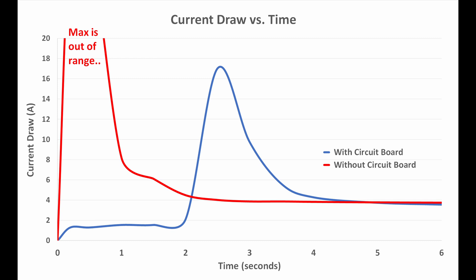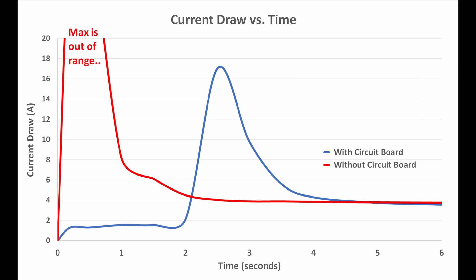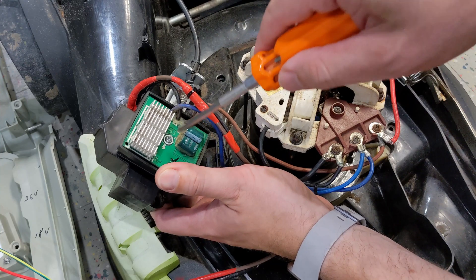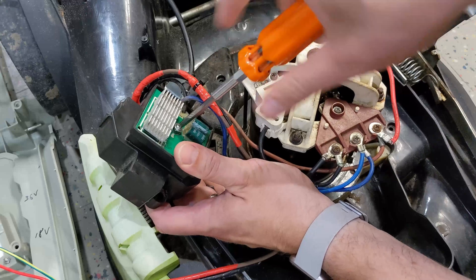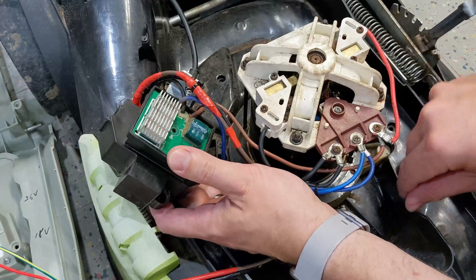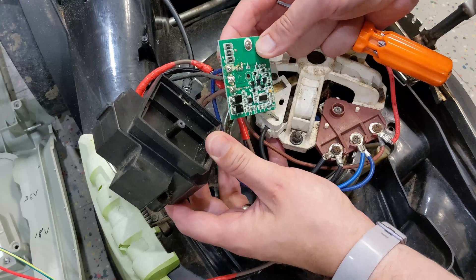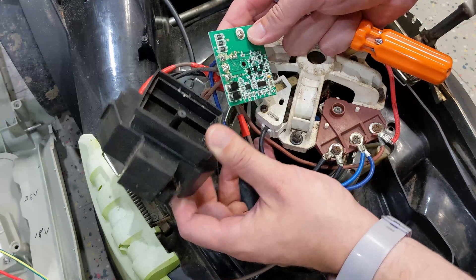Although I don't have the right tools to precisely measure the current draw profile of each scenario, I plotted a series of multimeter readings from a few test runs. My multimeter is limited to 10 amps maximum and has a slow sampling rate of about half a second, so take this graph with a big lump of salt. Although I do have an oscilloscope, I unfortunately don't have a current probe — yet. The second thing the circuit board does is cut off power if the battery voltage drops below a certain value. This would protect the battery from damage caused by over-discharging. In my case, the under-voltage protection feature prevents the mower from working in 18V mode, which I'd rather have the option to use.